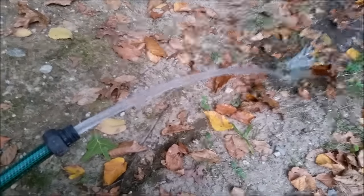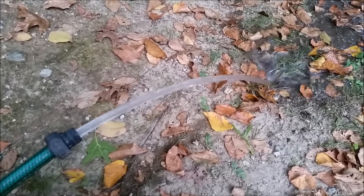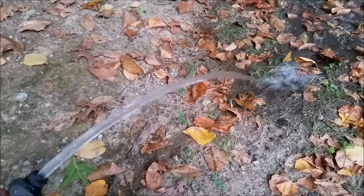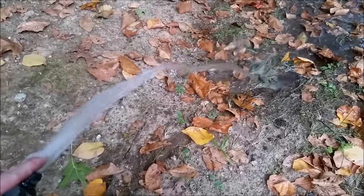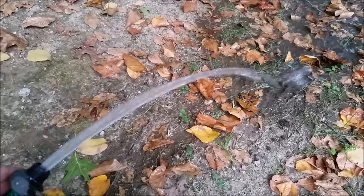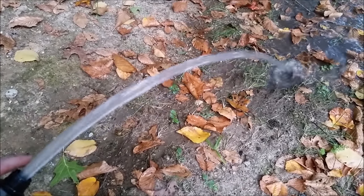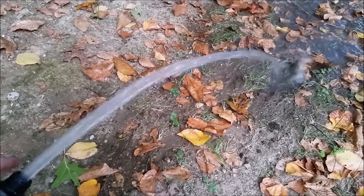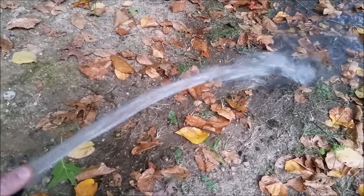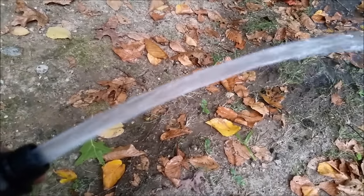There comes air. Getting more — pretty soon once it goes all the way through. You're going to want to run it for a little while to make sure it goes all the way up through the heating loop and then comes back out this hose. Water should come out cold as it's coming from the baseboard, and it should get warm once it actually goes through the boiler — and that's when you start to get the air again right here. Now the hose is just starting to get warm with our boiler-temp water, so we know it's coming from the actual boiler all the way through the line. We'll let it run for a couple more minutes just to ensure we get all the air out.